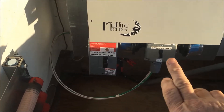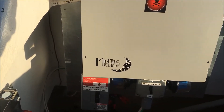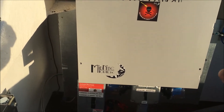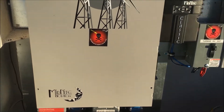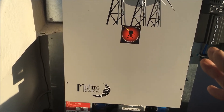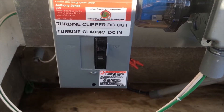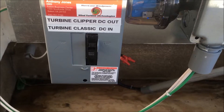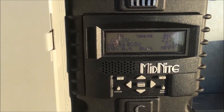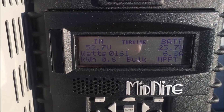We have the clipper installed. The power from the turbine comes in and goes into the clipper as three-phase. That three-phase is then converted to DC through a rectifier and monitored to make sure it doesn't go above the set point, which protects the rest of the equipment and controls the speed of the turbine. After that, it goes into this box — our clipper DC out going into our classic charge controller's DC in.